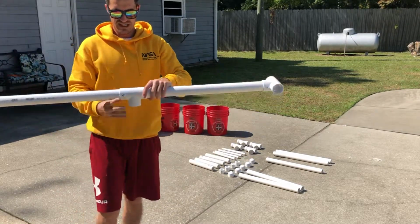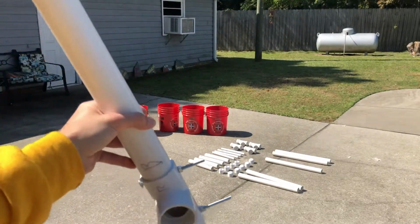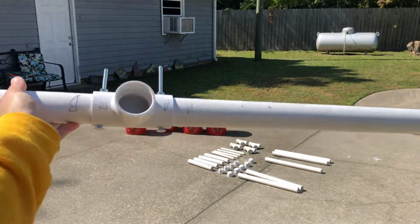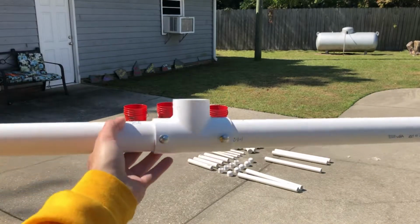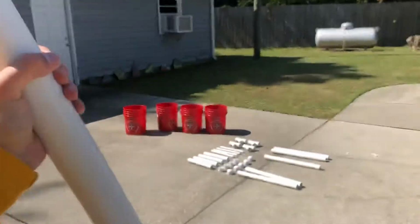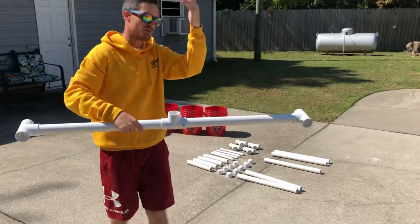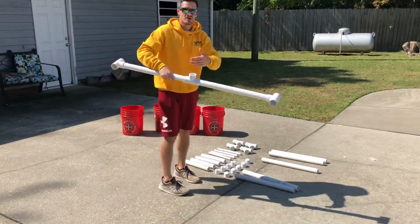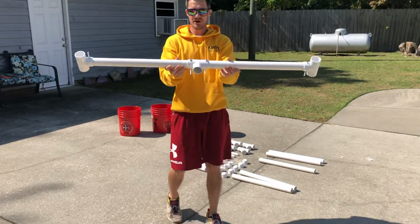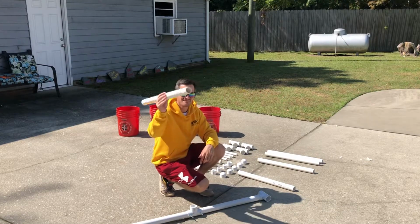So now what you can see is we've got our base. I want to make sure this is in the camera. We have our base where we've got a 90 degree, 90 degree, and a 90 degree. All with set screws going through them. So why? So this can't twist once we put our structure up. So now on both ends of our base, we're gonna take 1.5 inches.